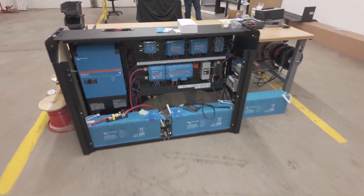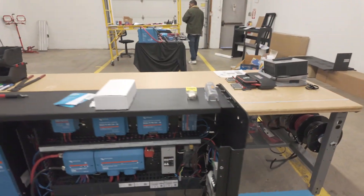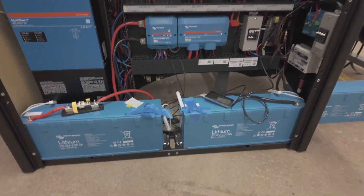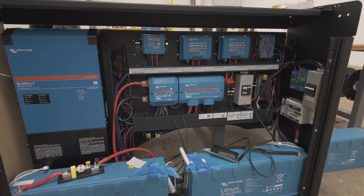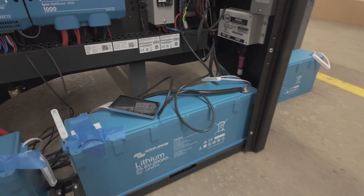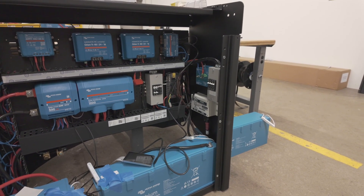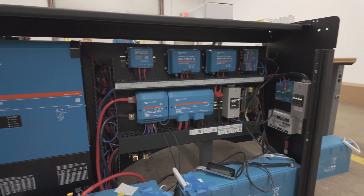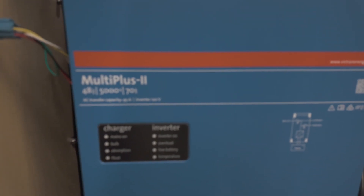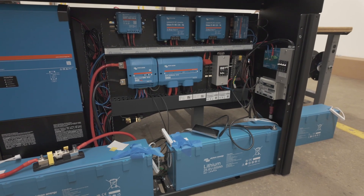Let's go look at Rover vans. This is gorgeous. This is inside their new Murphy bed platform — it's not quite capped off just yet. But this is that 48-volt system that runs on a secondary alternator. So there's quite a bit here that we don't have. First and foremost, these are the new gen batteries — the 24-volt new gen from Victron. And his secondary alternator. There's some doodads in here that we don't have. Last but not least, you'll notice a much larger multi-plus — 5,000 instead of our 3,000. So this thing's powered on, and we're programming today.